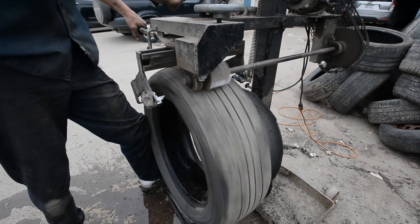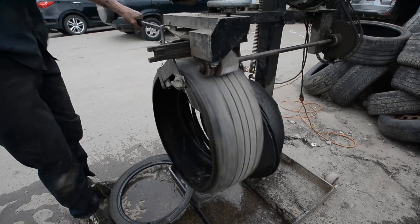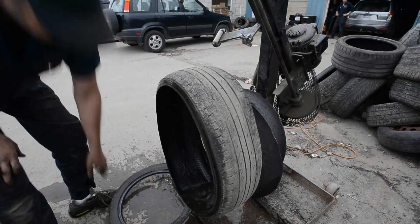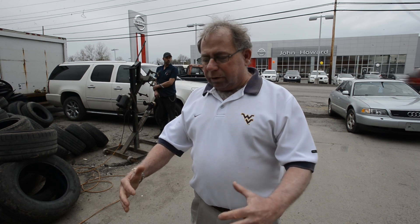To make mechanical concrete cylinders, we cut the sidewalls out of tires. We lay the cylinders down on the ground or in the road base, however deep you want to dig it out, and then we fill them with number 57 gravel or any derived filler you can put in that hole. After you get the cylinders and the gravel inside, it's ready to run on — the road is ready to go immediately.